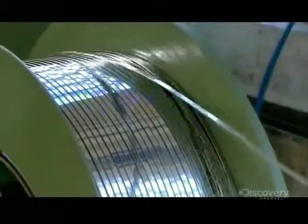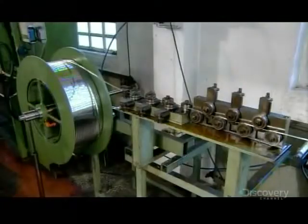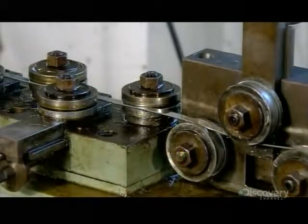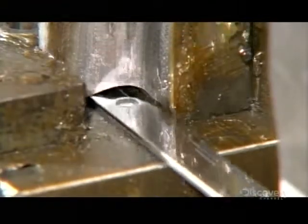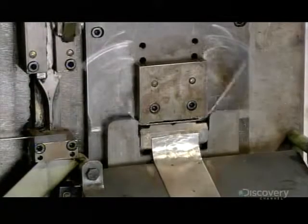Another model has a built-in tray to collect the grated food. A machine forms the pivoting handle, which enables the blade to stand upright in the tray. First, the machine cuts a strip of stainless steel to the required length, makes holes for a rivet on each side, then bends the piece to a U-shape.